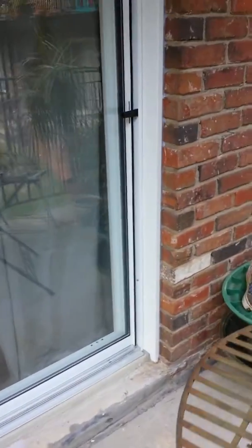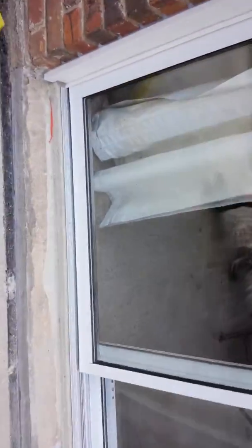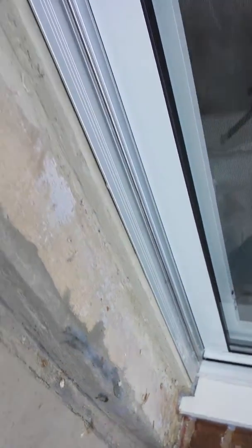I've just installed a Citation sliding glass door. What's special about this install is that the door foundation was completely messed up, so I had to build it up. You can see the lip from the outside — it was sloping from the track at the bottom, sloping into the house, so water was just flowing in. I built it up and then set the sliding glass door on top of it. I had enough room at the top to be able to raise the door.